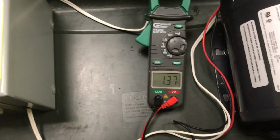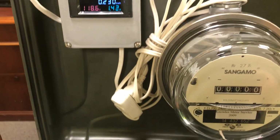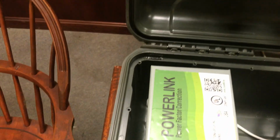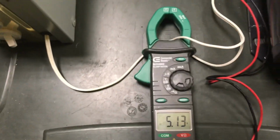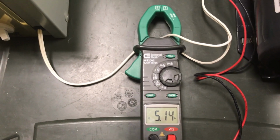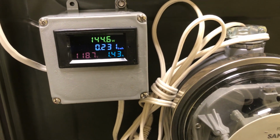and, well, wait a minute, what happened there? Now we're only pulling 1.4 amps, roughly, from the meter. There it is right there. But in reality, that motor has to have that 5 amps that we saw earlier. So how is the motor getting 5 amps of power that it must have to run when we're only buying 1.4 amps from the electrical company? Very simple.